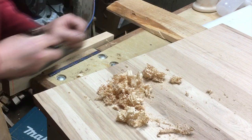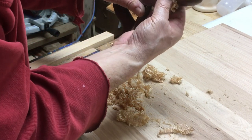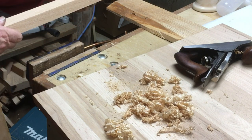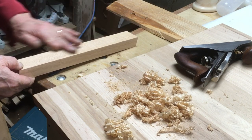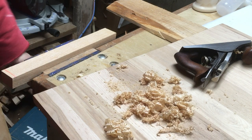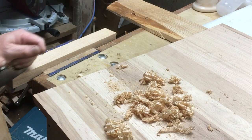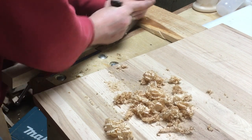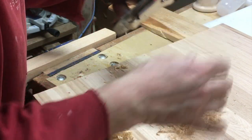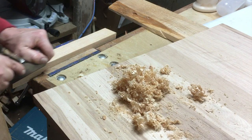It's a fun little plane to use. I don't know if it's the most practical thing in the world — it's more of just a thing to complete out the collection. But there are times with a stubborn grain in a small area where I can grab this plane and get a very nice smooth finish, as you would with any small smoothing plane. I've got a number 3 — it's a 603 Bedrock — that I tend to use more often for this just because it's a little bit bigger, and it's actually my favorite plane. But this little number 2 is not just a toy or a conversation piece. It actually works very nicely as a small smoothing plane, and you can see those super fine shavings off that piece of hard oak.